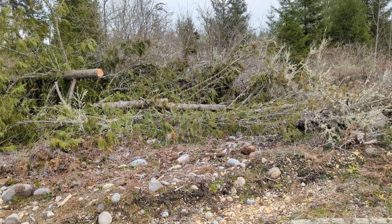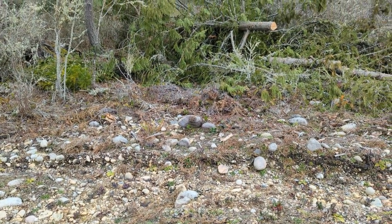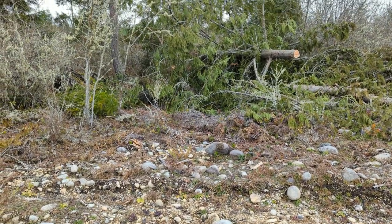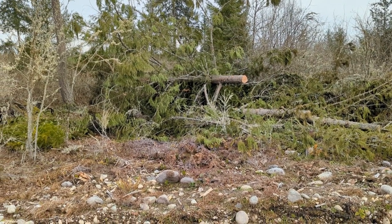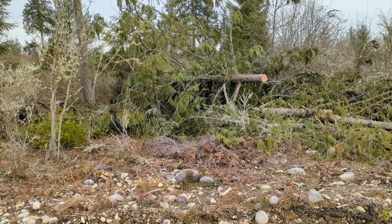You can see here it's a cedar tree I cut down. Cedar is a great type of wood for this sort of activity since cedar is less likely to rot, especially since it's going to have dirt on top of it. I actually put some plastic sheeting over the top of my wood so hopefully it'll dry out, not get wet, and the wood will last longer.